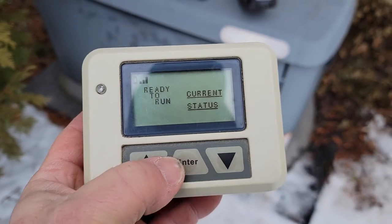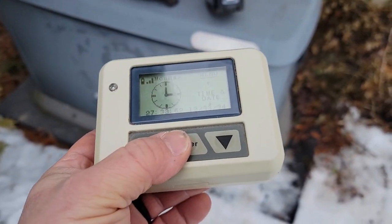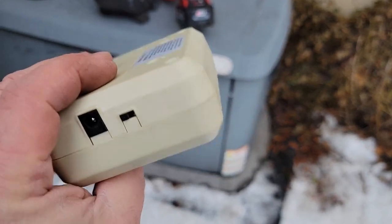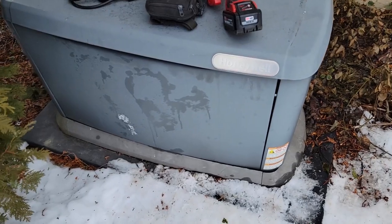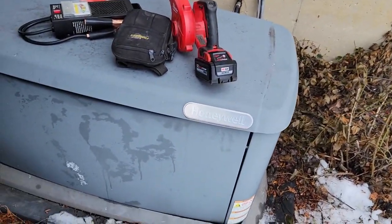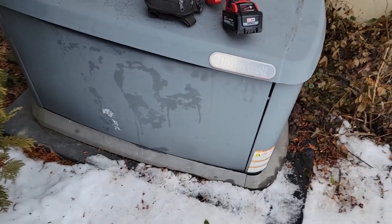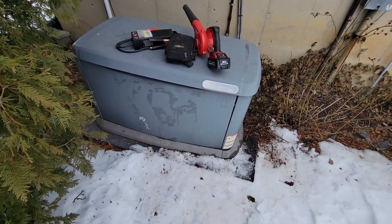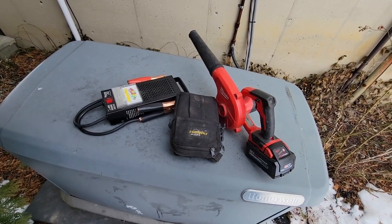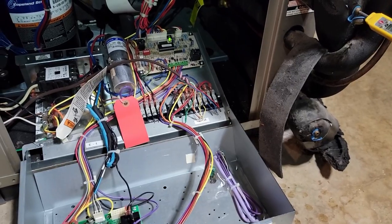The conclusion I've come to is: if you try to set the clock with the remote verifier it screws up the generator's clock. If you set it correctly at the generator it seems fine, but it doesn't correct on the remote no matter what. As soon as the remote loses power it loses the connection. I'm going to tell her it's pretty much shot and she needs a new battery. Everything transferred over, voltages and stuff are fine. My recommendation is to come back and do the oil change and replace the battery at the same time. The battery's good enough for now but not where it should be — kind of like bald tires, they'll get you to the store but eventually they'll blow.